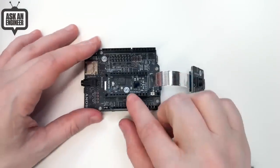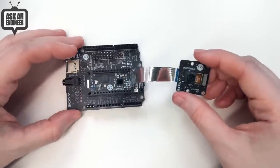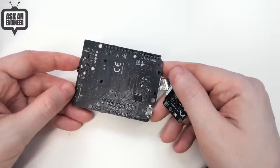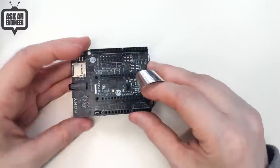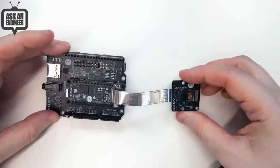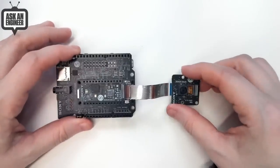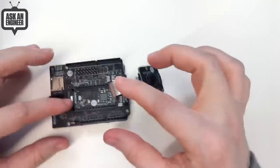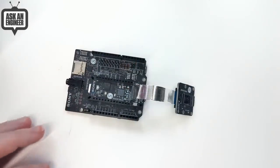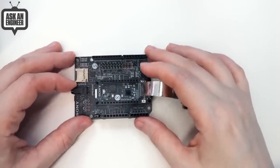These are coming soon, but this is the little main board and it has an antenna. It's kind of nice to see something from Sony — I used to work with Sony on a lot of things and they're always so beautiful. Our code now runs on it with not only Arduino libraries, but they did a special effort to get CircuitPython to run on it. It does have native USB because they've got TinyUSB running on this. It has a camera you can plug in, and you can plug into the headers to use the main board. It's a multi-core chip from Sony — very powerful. We'll have more about this, including a guide on how to run CircuitPython with it.